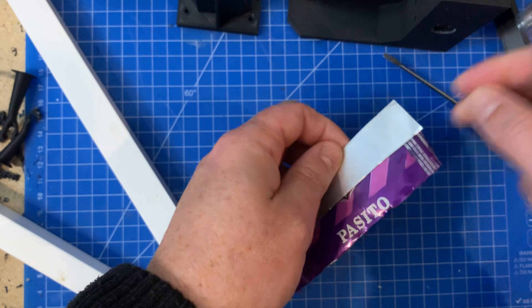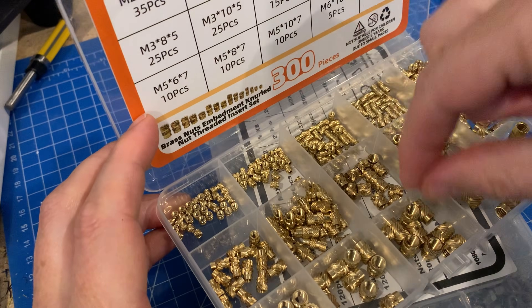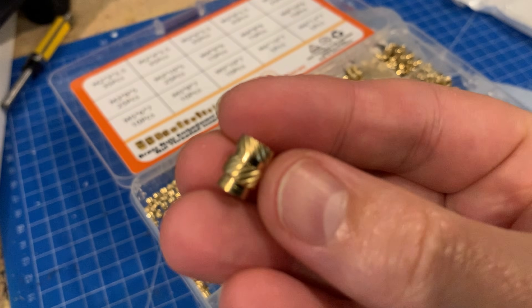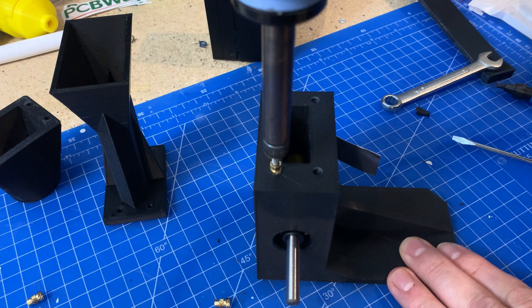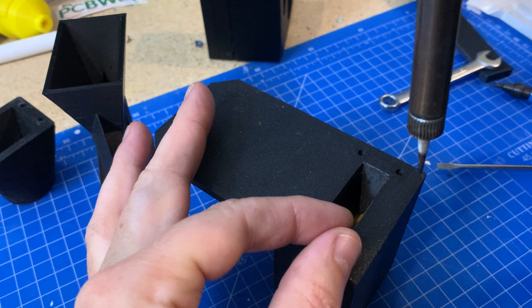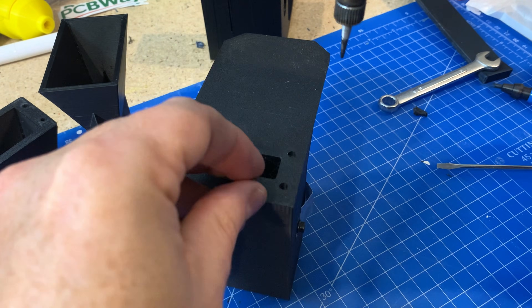If you do the same, those edges are going to be sharp. I also used some heat insert threads which I already had but you can pick these up really cheap — these were M3 6mm threads, link in the description. So I started putting in the threaded inserts. They can really only go into the main body side and get screwed in from the top and the bottom. If you haven't used threaded inserts before, they really do give a level of professionalism to your prints, so if you're new I'd suggest getting a kit of a whole bunch of different sizes and giving them a go.